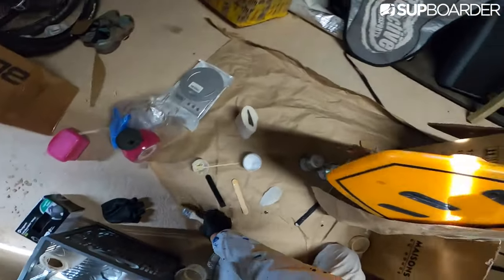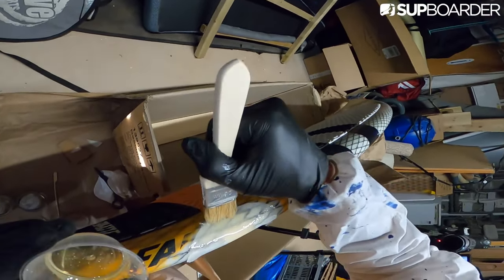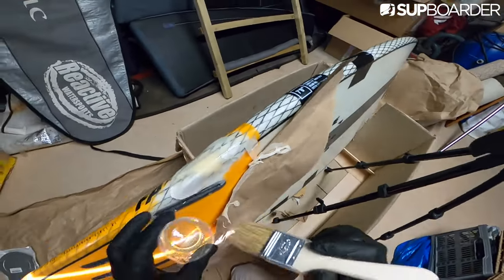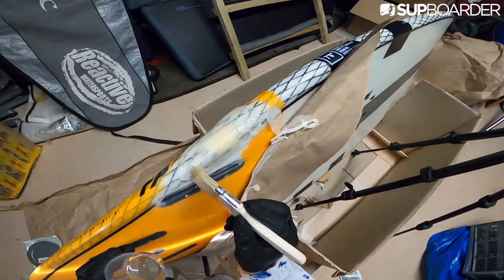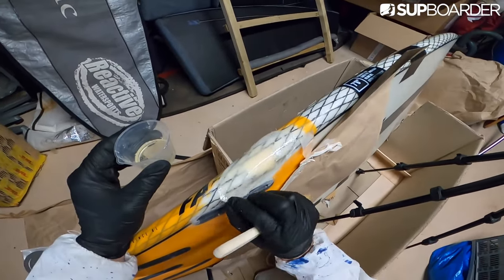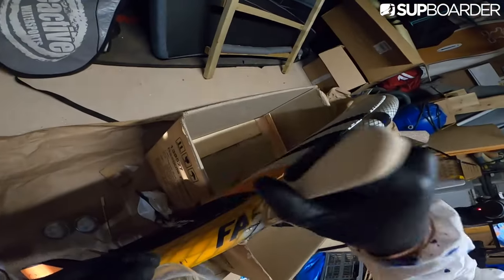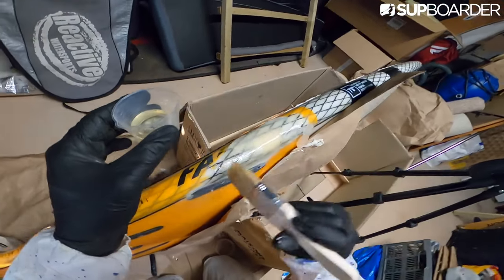Scrap that. I'm going to use a brush, because without the brush, it's really hard to wet out the resin. You can see what I'm doing, see the glass going translucent. I don't want to get too much on there, because too much resin makes the end product not as strong. I probably should have just painted a layer of resin on there. In fact, I'm going to peel it back like that, get some resin on that side, and that should help wet it out. So you can see it's sitting down better now. That's just because it's wet out.